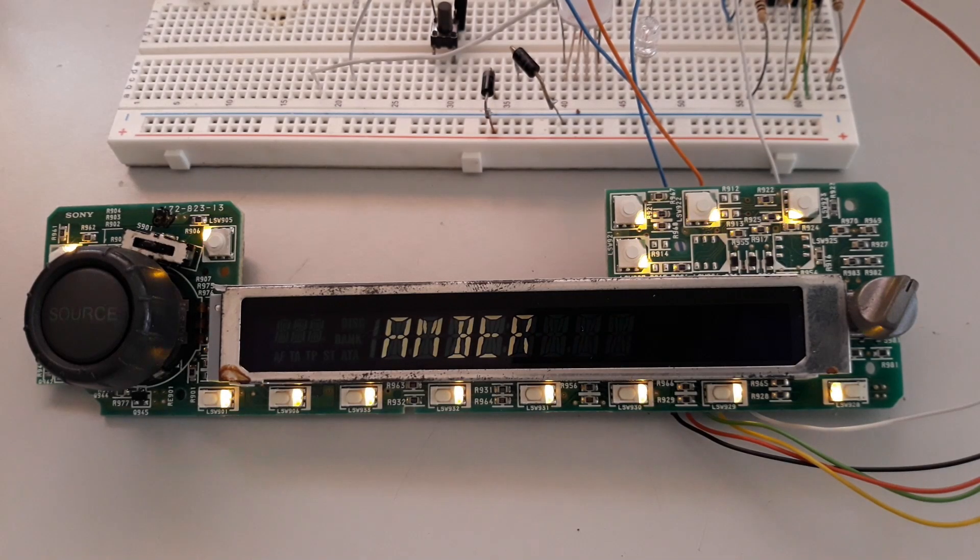We thus have the base of Q942 equal to plus 12 volts. By the values of the resistor divider, it equals plus 3.61 volts. This voltage will place our transistor in the conduction zone, feeding the LED circuit, which in this case is the amber. The green circuit is identical.